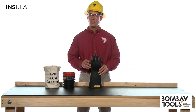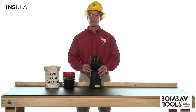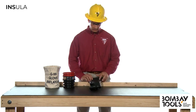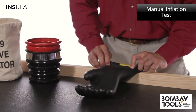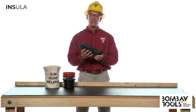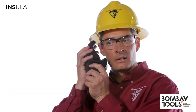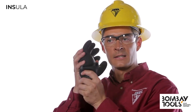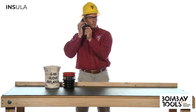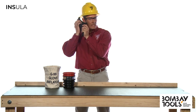Let's move on to the next part of the inspection, the inflation test. There are two ways to inflate gloves, either manually or using the portable inflator. To do it manually, roll the glove up about one and a half inches. This will trap air in the palm and fingers of the glove. Then squeeze it and hold it up to your ear, listening and feeling for any air leaks. I can feel an air leak in the palm of this glove.